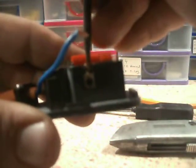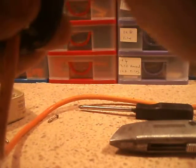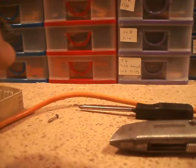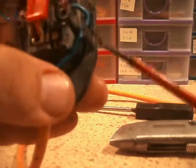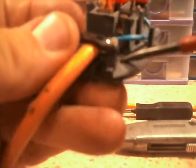I didn't actually check to see if the screw was unscrewed far enough, and it isn't. But these sockets are always the same - you're live on your left, neutral on the right, as you look at it. They're labelled anyway, so you just look at the labels. N for neutral, so you'd put your blue there - there's an N just underneath the wire. And there's a live marking there, a nice L. There should either be an E or the Earth symbol - and yes, there is an E down there for the Earth.